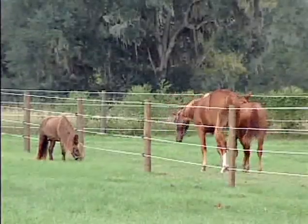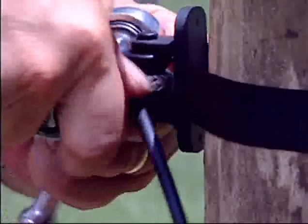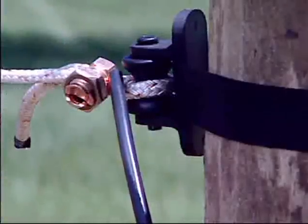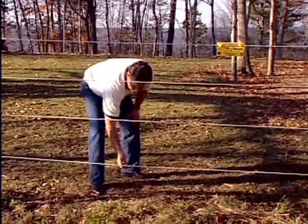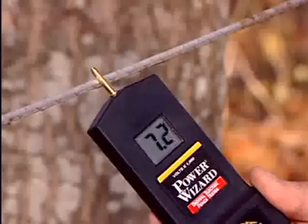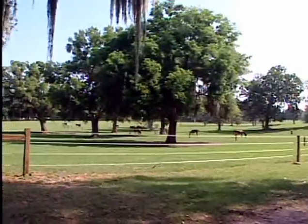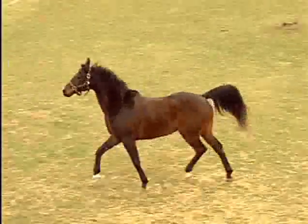Make sure that if a post shifts, you reset it, tamp and re-tighten the braid. It's always a good idea never to turn off the electricity to your ElectroBraid fence unless you're working on it and the horses are not left unattended. It's very important to test your fence at the highest and driest points, and test your fence to the soil at the furthest point from your ground system. Test your fence often, making sure you have 5,000 volts at all locations. With proper installation, regular inspections, and proper electrification, your animals will be happier behind your ElectroBraid fence.